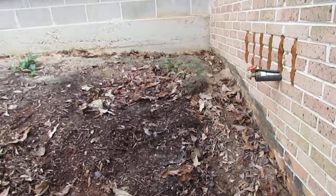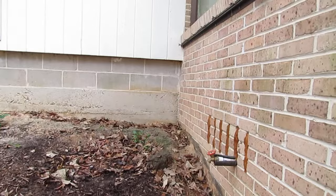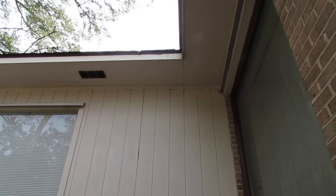Some people say, why not use gutters? You can. You still should have leaders that take the water away from the foundation if you do that. But in my opinion, this is better than gutters because gutters do require maintenance. And not only that, I've found that when gutters are against the fascia up there, it will cause rot. And even the gutters with good screen systems can get clogged.